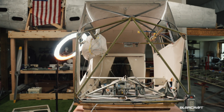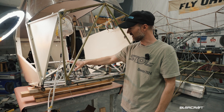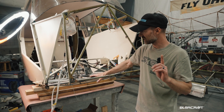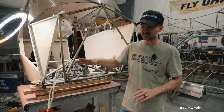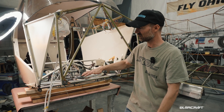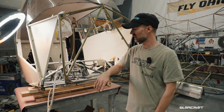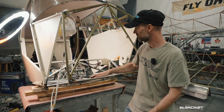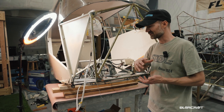This is going to be ready to rock and roll. What I still need to do is basically some final cleaning — there are some more tubes I need to clean up. These old airplanes don't look that pretty underneath. But one thing I found about this Clipper in the process of removing the primer is I didn't see any pitting, which is pretty surprising on a 1949 frame. That makes me feel a lot better about the rest of the fuselage in terms of rust and pitting condition.